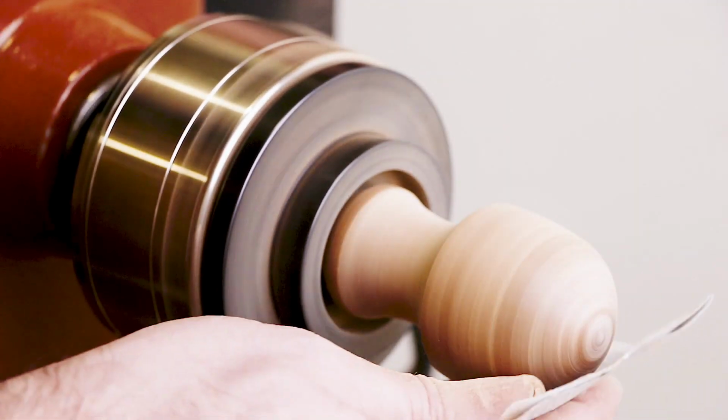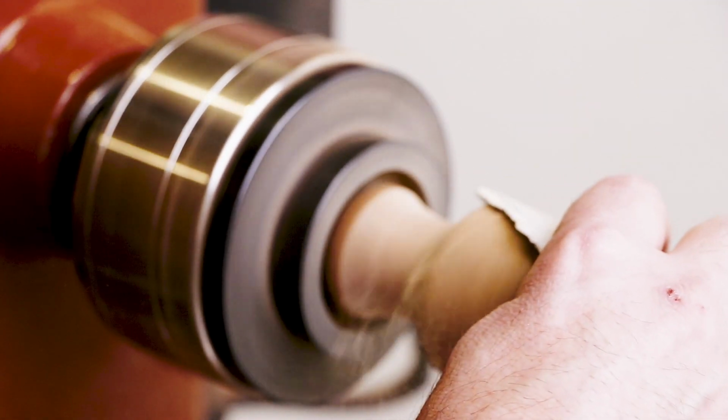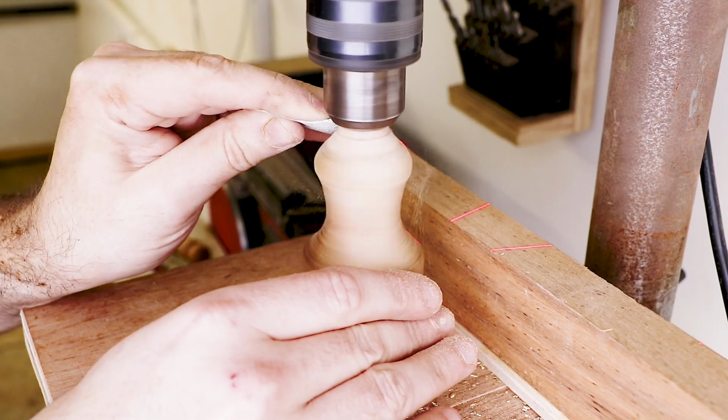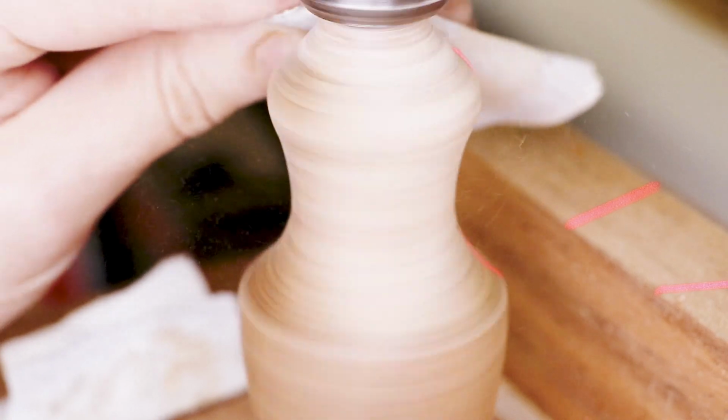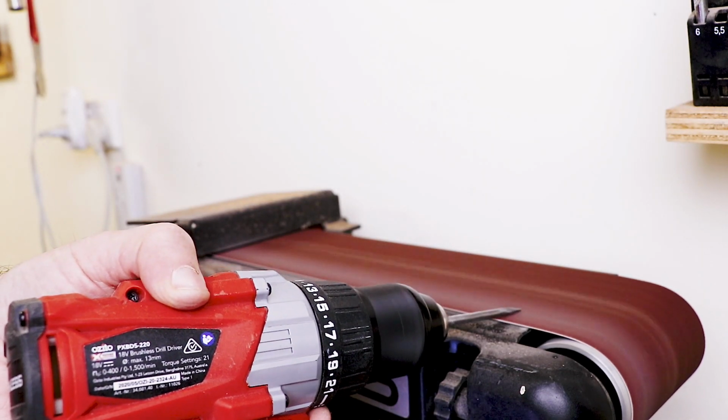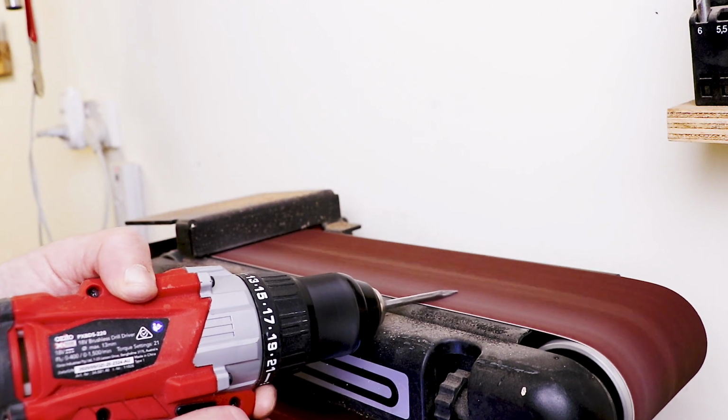While I did get my confidence up and managed to use the tools close to the jaws, I couldn't get all the way into the base of the tenon. So to smooth that area out, I ended up chucking the awl in my drill press and then I safely sanded it through there. For the pointy part of the awl, I decided to use a drill bit. I really like the effect that the spirals give it.